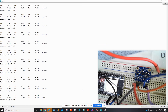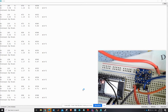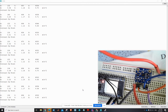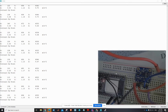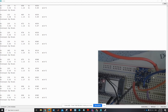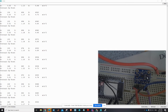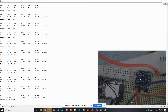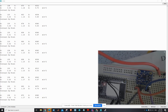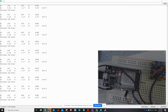Now I wanted to get my accelerometer hooked up. You can see I've got this one here — the MMA8451. This is a breakout board designed by Adafruit and it's designed to run at five volts. The chip itself is a 3.3 volt chip, but it's got level shifting logic on the right-hand side and a little voltage regulator to drop the voltage down.